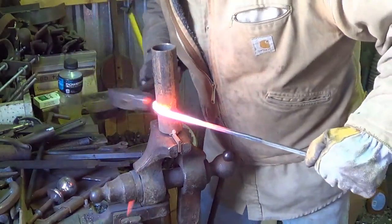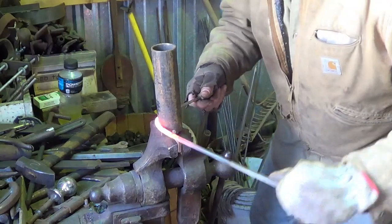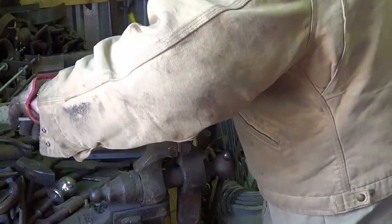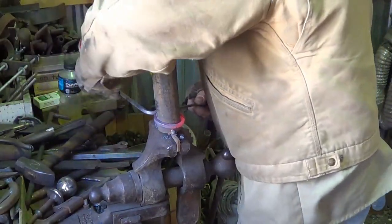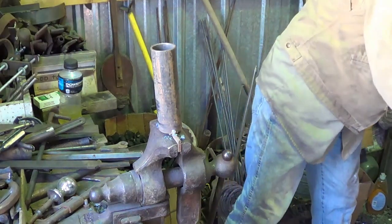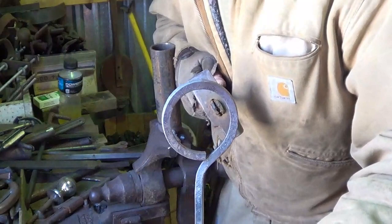I'm tapering the beginning of this so that the end is nice and round — that way we don't have to worry about it being tight. With this jig I can play a little game, get everything where I want it, and bend it right back if I have enough heat. Don't lose your heat! There you go. I use that jig for bending a few other things so I know what I want to do. This loop is centered on the end, just like the other — not perfect but it'll do.